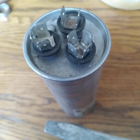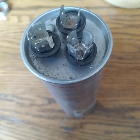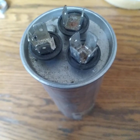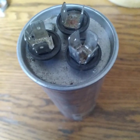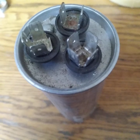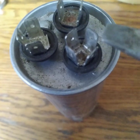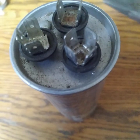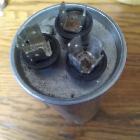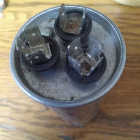The bottom of the capacitor may be fine, but if you touch the prongs on top and cross over, there is a possibility of encountering a shock or some type of hazard. It's nothing to be totally worried about as long as you use prudence and realize it's energized. Even after de-energizing, there's no need to touch the prongs. The new capacitor won't be charged — it's only the one that has already run that will hold a charge.